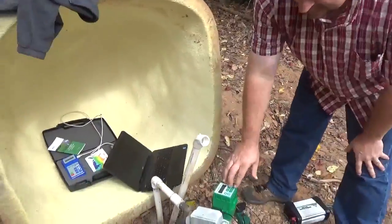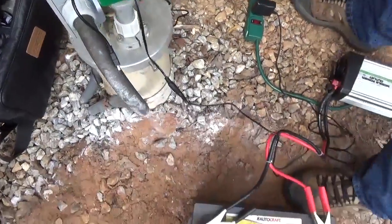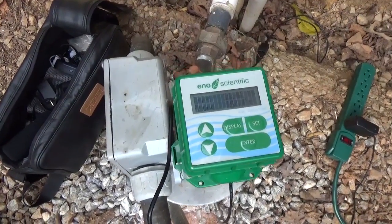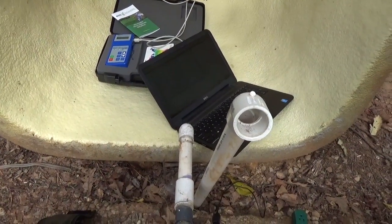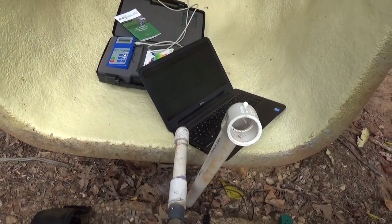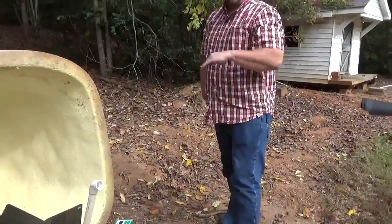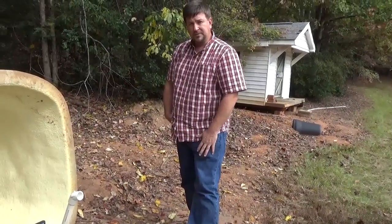Before you pump your well dry, you want to know what's going on. This thing does require some power, but not a lot — about one watt. My well is far from my home, so I brought a battery and inverter down here to run it; it could also be a small solar panel and battery charging system. We've got it hooked to a laptop, logging a sample every minute to find out the static water level, dumping it to a text file that we can then graph. It can take 25 million data points, so you can watch your well over any period of time.